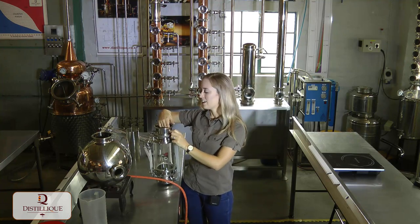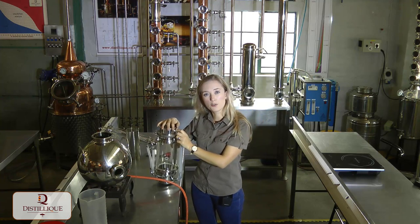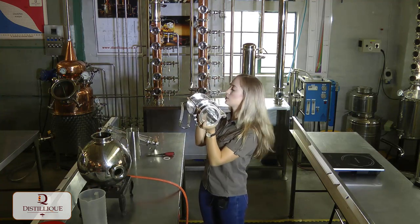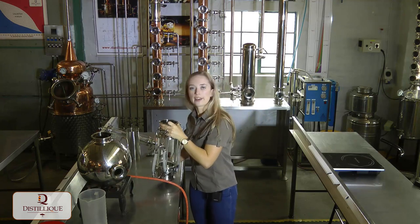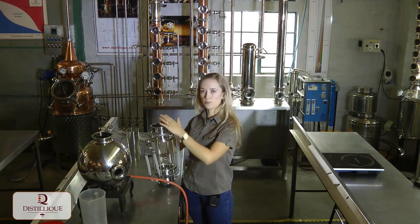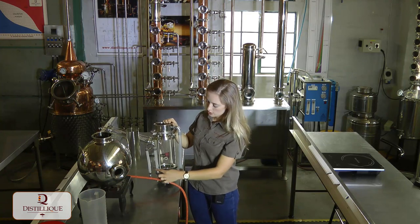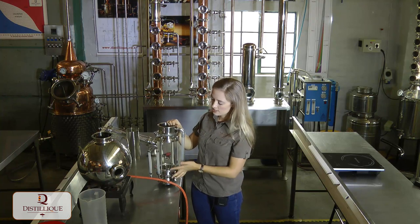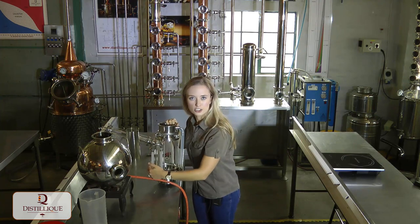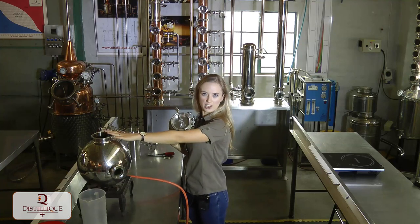The condenser is going to condense these vapors back into liquid form and it's going to drip back into this glass chamber. Remember it's completely sealed off, so nothing starts draining back yet. As we continue with heat addition, more vapor is going to form, travel up the tube, be condensed, and drip back, slowly filling up this chamber. Until it reaches the maximum height of this bend — so this tube is basically a level indicator. As soon as the liquid reaches the height of the bend, it's going to start draining. All of the liquid inside will drain back down this tube into the boiler, and then the cycle repeats.